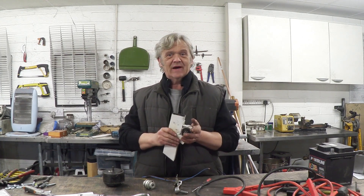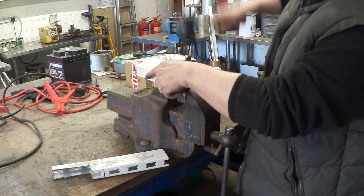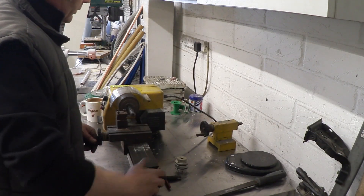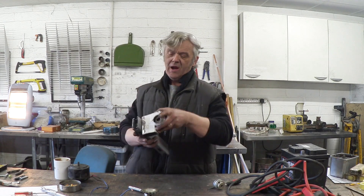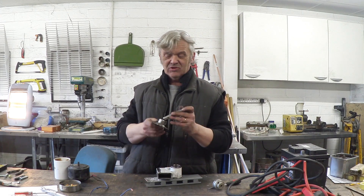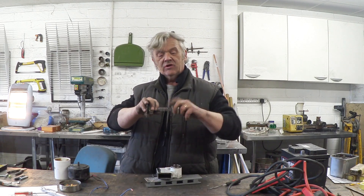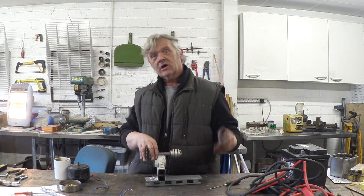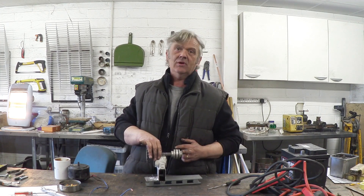First things first, get this out and turn it down to size. This bit and this bit form the frame — that gets welded on there and carries the axle. I've turned the axle down so it now fits in there, cut it to length. The cotter pin goes in there, and then this flexible coupling goes down on the turned part of the axle. That actually makes our transmission. We can then put a normal bicycle chain from this to the chain wheel left on the original wheel, and any 8mm motor will go into that shaft. That's the transmission basically put together.